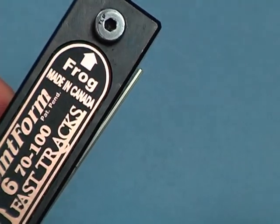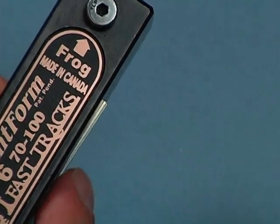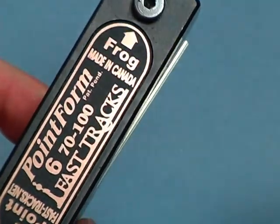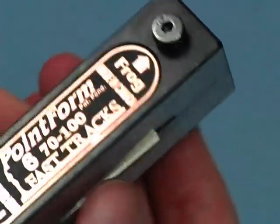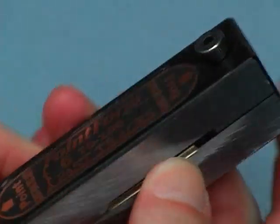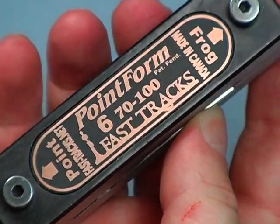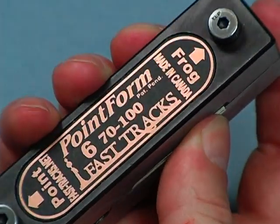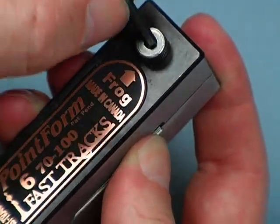What I usually do is I stick it out and then back it up like that. I want to be able to see the whole head of the rail — we're looking down on top of it, seeing the head of the rail. Once more, out and just back it up to there. I put a little bit of pressure on it with my thumb and lock it in place. I like to hold it in with my thumb up against the side, make sure it's sticking out the right amount, then tighten it up with an Allen wrench.